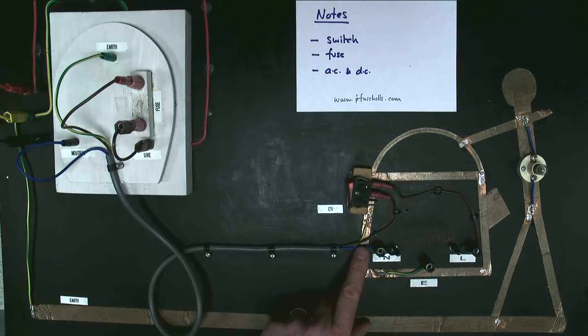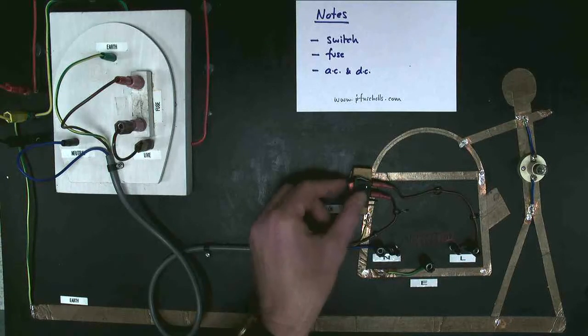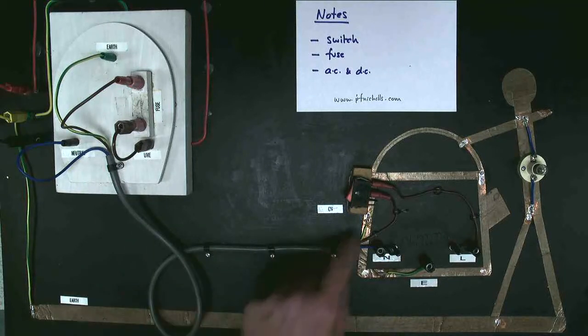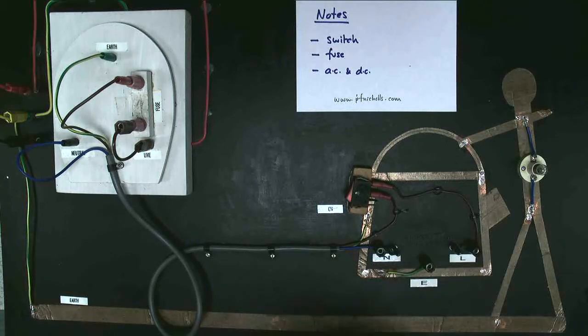The neutral wire is effectively tied down to ground — it's connected to earth at the power station — so it will only ever be a few volts, perhaps 10 or 20 volts, above earth, and it's unlikely to electrocute you. The live wire, on the other hand, is oscillating at 240 volts above and beneath the earth potential of zero, and that is the one which is going to electrocute you. So the switch is in the live wire because the live wire is at the voltage high enough to electrocute you. When we turn it off, the live is disconnected first, so if we touch the element we wouldn't get electrocuted.